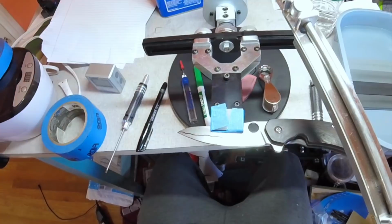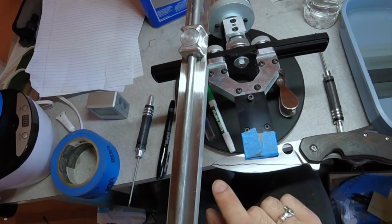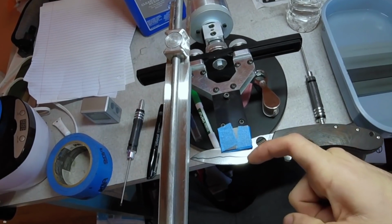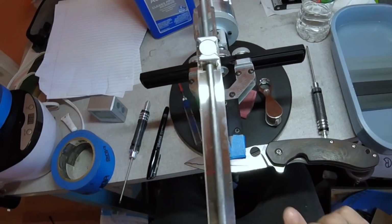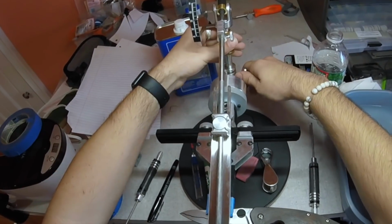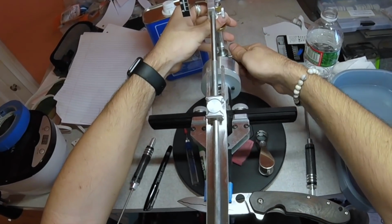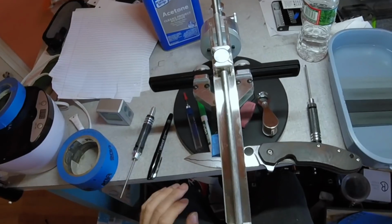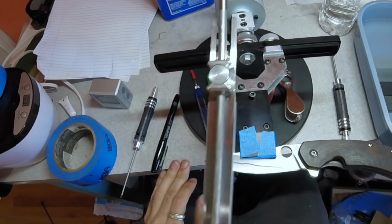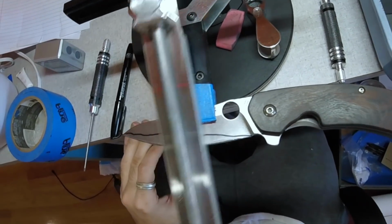Okay. The Sharpie's being removed, right, but only from the shoulder and not the apex. So that means you want to raise your angle, right? So I was at about 19. I'm going to raise it until it's about 20. See how that goes. Okay, and I'm still not removing all the Sharpie.